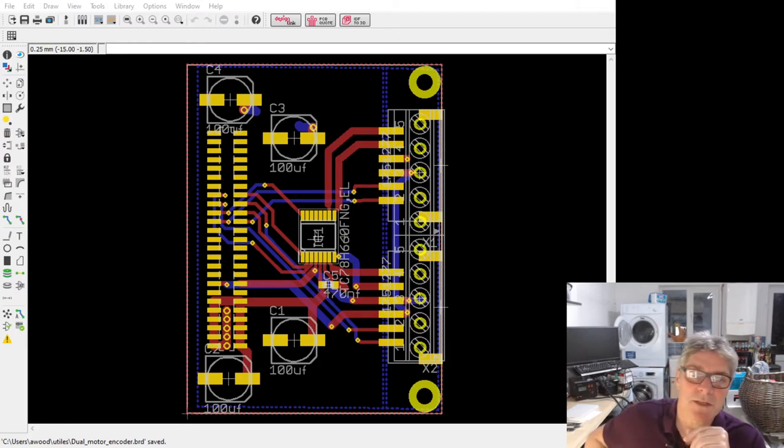Although it's possible to use it as an interconnect, kind of PoE interconnect in a larger robot. I've got some ideas for doing that actually. But that would involve putting more than one RJ45 jack on each tile. I'd be looking at putting two on each tile and being able to do something equivalent to maybe EtherCAT.